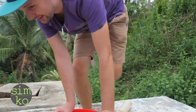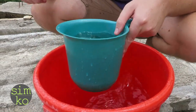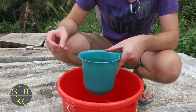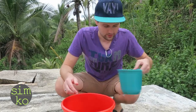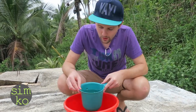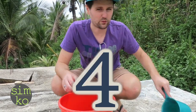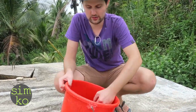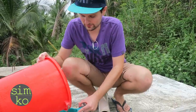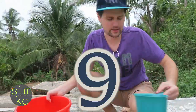So this is the water we collected and we stopped the time. Now I'm trying to measure — this marking is one liter. So we have one, two, three, four... nine liters of water in about six seconds. Now I know the flow rate.